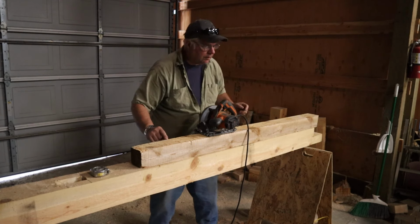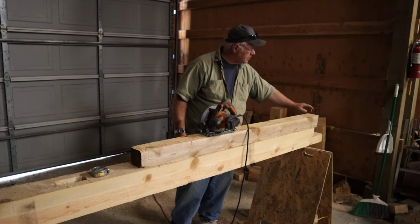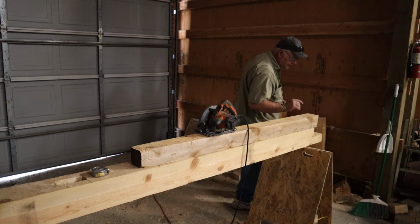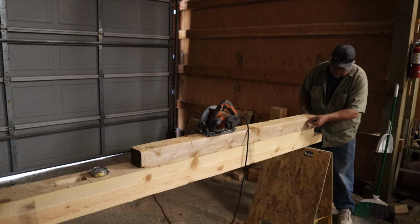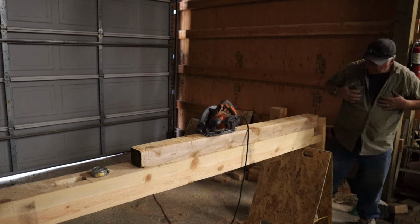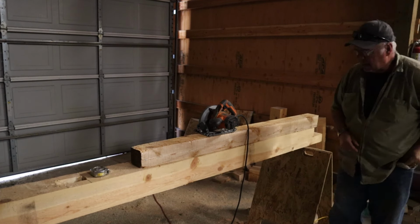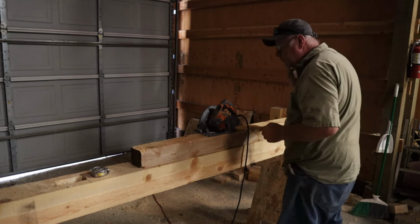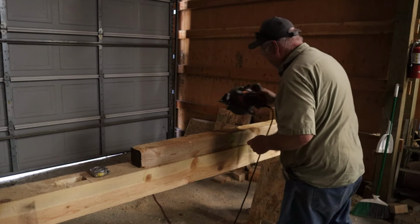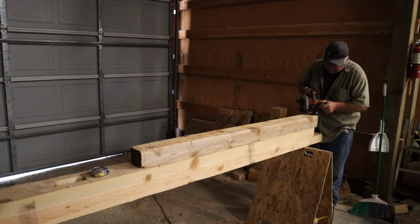And I'll probably do this end first so that you can see what I'm doing and cut that piece off. So what I need to do is cut a bunch of strips so that this 1 inch piece carries through all the way. And I'll get some earplugs in, I'll rip that, and then I'll get a chisel, the one I like using, and then I'll show you kind of a secret that I've been doing. Kind of makes it easier. And that'll give you kind of an example of what it looks like. And I, at random, just cut 1 inch strips and then chisel it out.